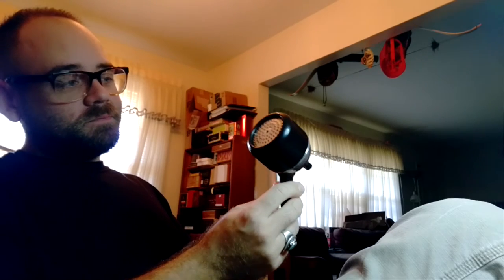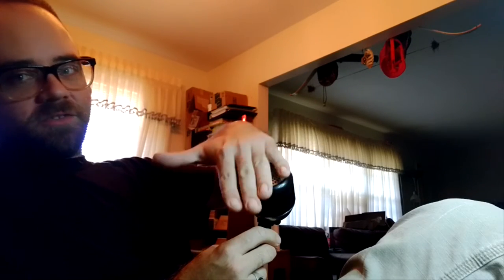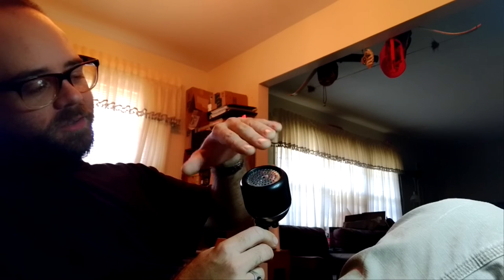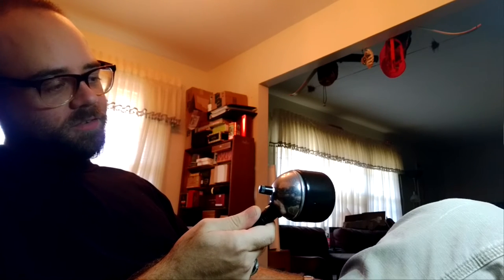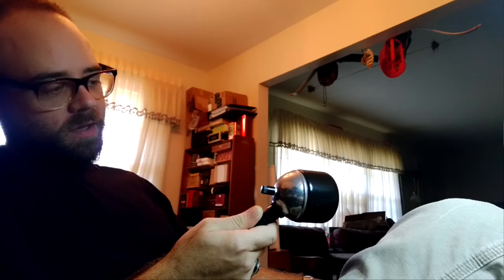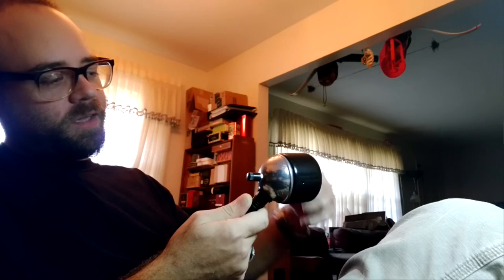It took me about three to four days. We started with a two-and-a-half inch PVC pipe cap. I had to sand off the brand name, manufacturer, and code numbers that were either printed on or raised up in the PVC itself. Then I drilled a hole down through the top and got a galvanized steel dome cap for a chain link fence pole — they didn't fit exactly, so I had to grind out the inner diameter of the PVC to mate with the dome cap.